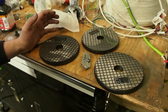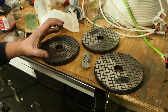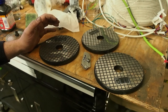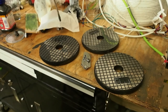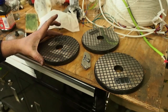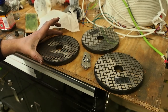My goal in taking these to the next level was — when I did the first project, I didn't have an optical flat, but I got one since then. In order to use the optical flat, you really need to have a reflective surface that's almost like a mirror. I don't know if it's going to show up in camera, but this is pretty reflective at this point — I'd say about 60% reflective. I took this down to one micron. I only did one pass at one micron. I think where I left off in the other video, I had done 500 grit.